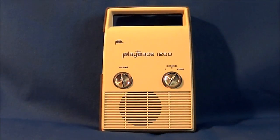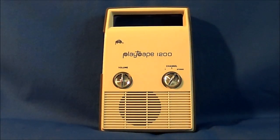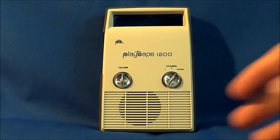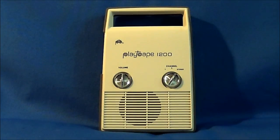So anyway, after that, the sucker, sure enough, came alive, but the volume was real nice and scratchy, and as best as I can tell, the knobs are not detachable. So in spite of that, I nonetheless tried to spray it out with some DeoxIT, and it at least reduced the scratchiness. It's still there.